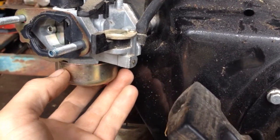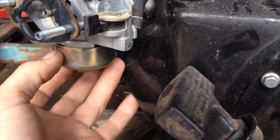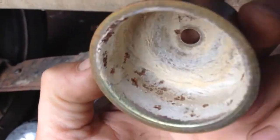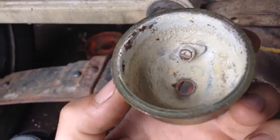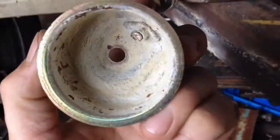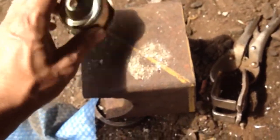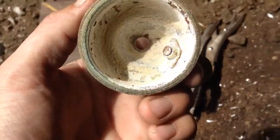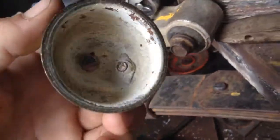It's time to get this motor going. There's one bolt in the very bottom of the carburetor bowl — 10 mil — and I took it out and it's just full of powdery dried-out fuel. Probably the ethanol stuff. That's why, with small engines, you're not supposed to use any more than 10% ethanol — it says right on the fuel cap. So I'm going to have to soak this and clean it.